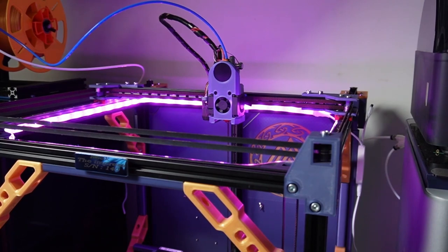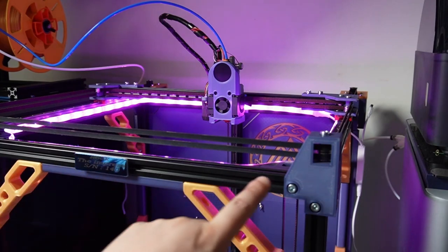As drivers, of course, we're using TMC 2209 drivers for the MKS Monster 8. It's a pretty silent system, because this is an open printer, compared to Bambu or the K1 Max. We're also using a Creality K1 Max print bed, 220 volts instead of 24 volts. The good thing about that is it heats up really fast. The bad thing is you need an SSR, a solid state relay, in between. Otherwise you won't be able to connect it and get the source that it needs, which is 220 volts to the bed itself. All these parts, as you guys might know, are printed.